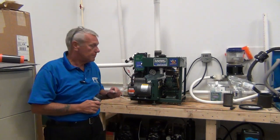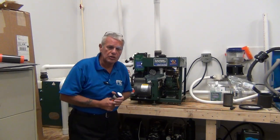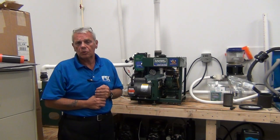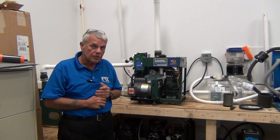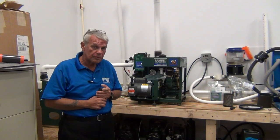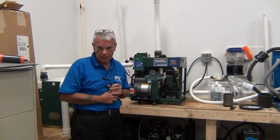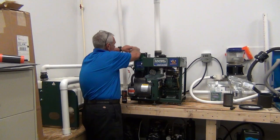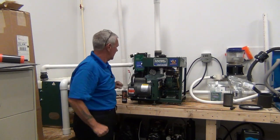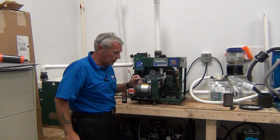We've checked our inches of mercury. Now we're going to turn the pump off. Very important safety issue coming up, ladies and gentlemen. Most of these pumps are remotely switched on a remote wall switch. You could have the wall switch turned off, and the staff or the doctors could come back from lunch or from their break not knowing you're working on the machine and turn it on. This machine has belts — it's very easy to lose digits, fingers, and everything else attached to you. So for safety's sake, we are going to totally power the machine down simply by disconnecting the power and waiting for all the LEDs to go off. Now we're fine for our maintenance and to do some further checks.